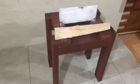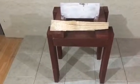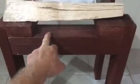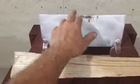This was actually made from three two-by-fours. Several people have seen it — this is the second one I have. The first one I picked up at a garage sale. This one I made by hand from the prototype. It's 16 inches high, and what you want to do is double the two-by-fours across here to give that extra strength, because you're doing that downforce with a hammer.